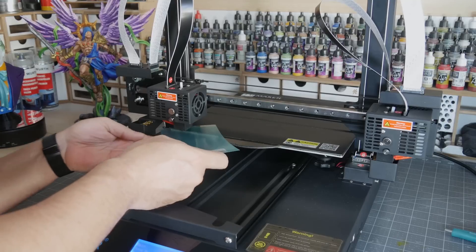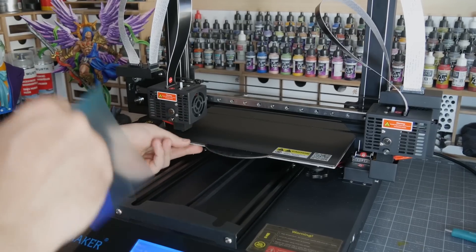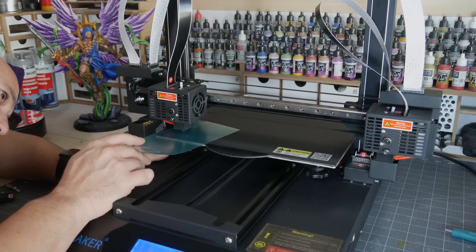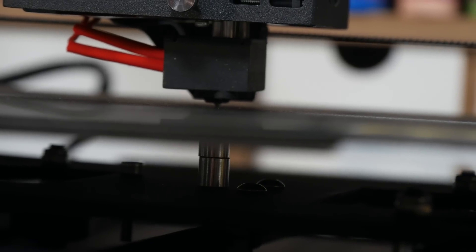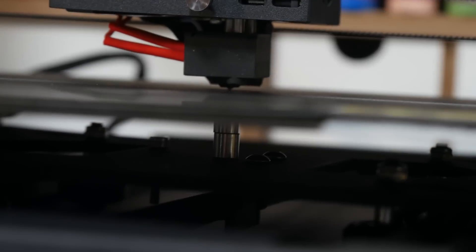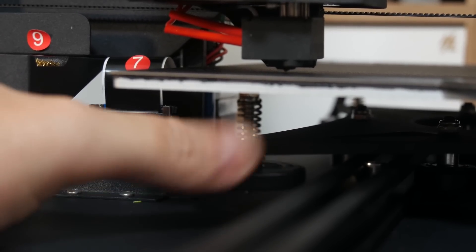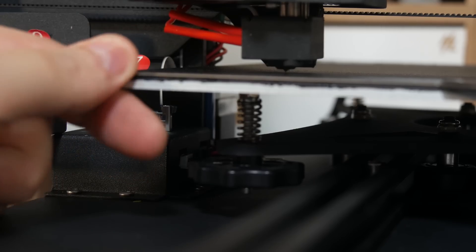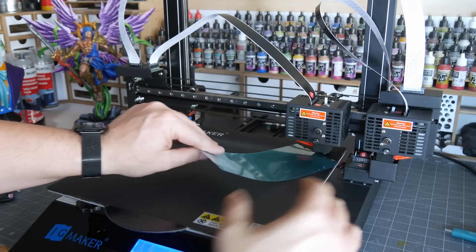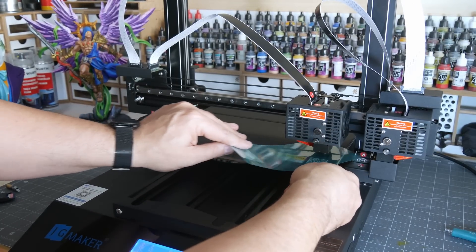Setting up the printer for printing is relatively straightforward, however it does have a caveat. The printer does not have auto bed leveling — not even assisted bed leveling — it has manual leveling only. This is made slightly more complicated by the fact that there is a locking mechanism in the center of the build plate — essentially a screw attached right in the center under the heat bed at a fixed height. While you have four knobs to adjust the corners, everything depends on how precisely the z limit switch is installed. The idea is to first align the center of the build plate with the nozzle, set the z offset for the width of the paper, possibly adjust the z limit switch, then adjust the four corners.